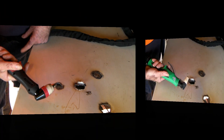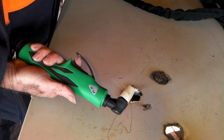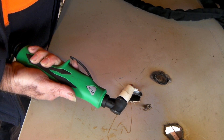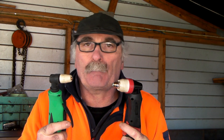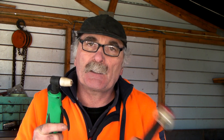And this one here is the touch torch or the non-pilot arc torch. When you push the button on this you get air but you don't get the flame coming out of it. You push the button on this one you get air and no flame; you push the button on the other one you get air and flame. So guys, that's the non-touch and the touch, pilot arc and non-pilot arc torches. A lot of you new fellas - hopefully this helps you a little bit when you go and decide what you want to buy. Remember to check the links below - I've got all sorts of videos about pilot arc, non-pilot arc, how to convert your torches and all sorts of other bits and pieces. Don't forget to check out my website peachtools.com and remember to like and subscribe. We'll see you next time, bye bye.